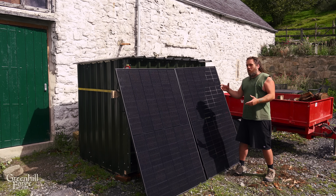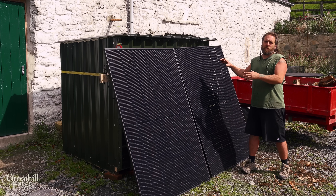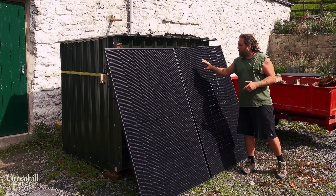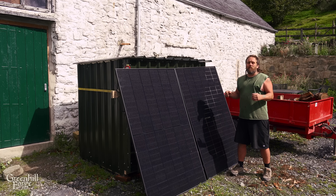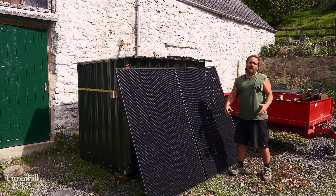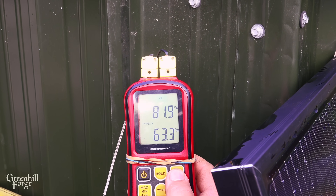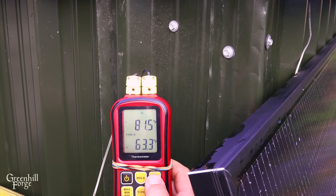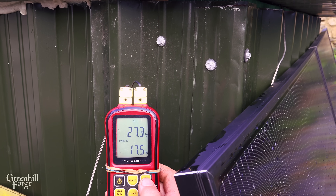I'm going to be taking measurements of the moisture in the wood at regular intervals so I can get really detailed results of how well this is working. After the testing phase, when I set this up in a permanent location, I'll actually switch the kiln around so that the door is facing on the north side, so the panels can be permanently mounted against the back wall and I'll always have easy access to the front door. It's all up and running now and I'm taking temperature measurements of the inside and the ambient temperature outside. The system does need quite a bit of sun to run at its peak, and it's not a particularly sunny day, but for the first temperature readings, it's about 63°F outside and the kiln's up to about 82°F on the inside — that's 17 degrees Celsius outside and 27 degrees Celsius inside the kiln.